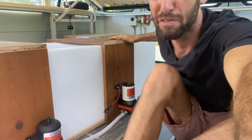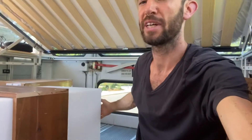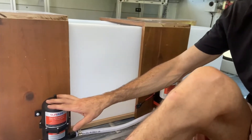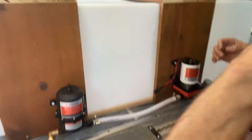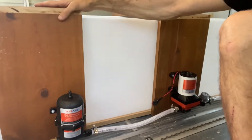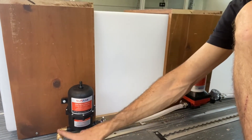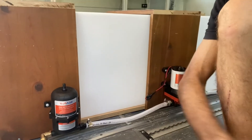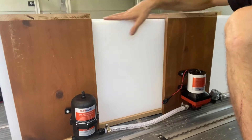I figured: what is a water system made out of? It's made out of a water tank, and then it basically has a couple of connectors in the back, and then it has a pump and an accumulator. That tees off and goes on to the rest of the plumbing system. But I figured, why not make this whole system one standalone unit that can be moved? The interface to it is just one half-inch PEX elbow connector, which you can run to anywhere — to the side of the bus, up, down, wherever you want. The beauty of this is that it's literally one unit.